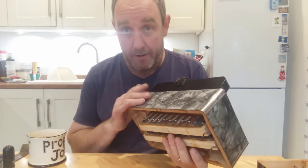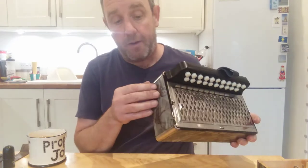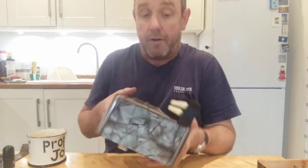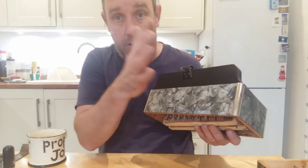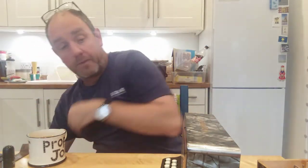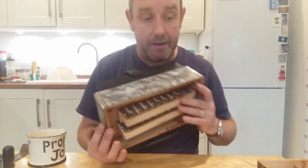Just a quick update - it's all going well. The last thing I did was gluing on some of the veneer that was peeling off from the sides of the Melodian. I used some super glue and then put it on a flat surface with some heavy books, and that's all gone really well. The next thing is that on the back there was a bit missing of the veneer, so I bought some veneer, cut out a cardboard template for exactly the same size, cleaned the wood up with some sandpaper, applied super glue, rested it with heavy books overnight. That veneer is now nicely stuck on and all the veneer has been done.